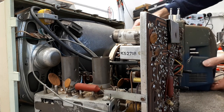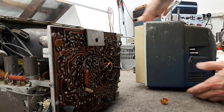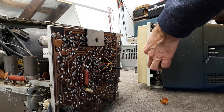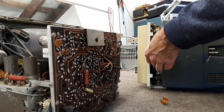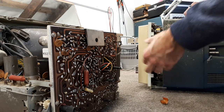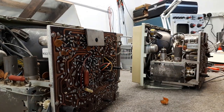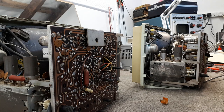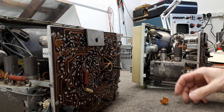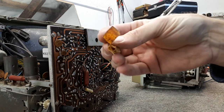Now I'll take the other one to pieces. So that's one of them there. This is the other one. Take that piece off under there. Look, I can already see a nice green bulged bulb, one of those horrible green Ducon caps. Oh, we could be in for some fun here with these, I reckon. And here's another, here's number two. With complimentary pieces of crappy old tape.